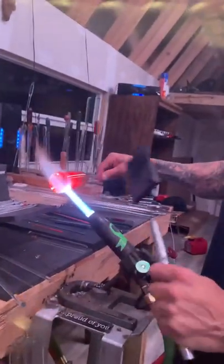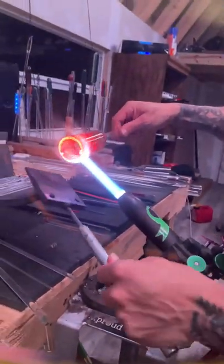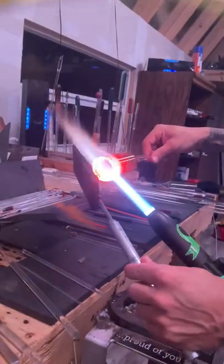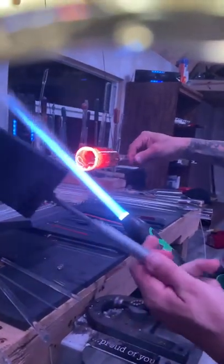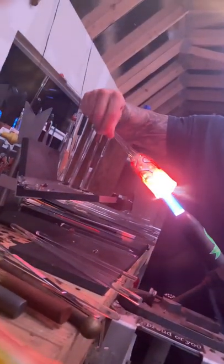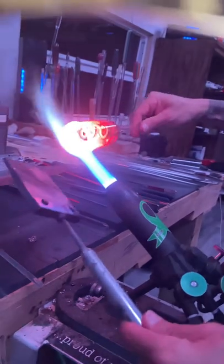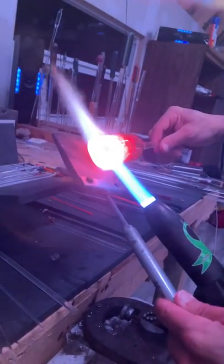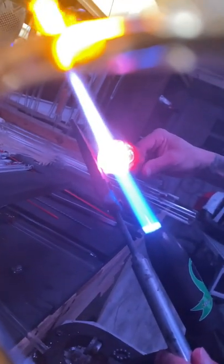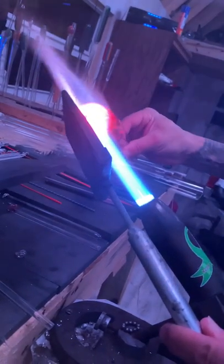I use a paddle, and the angle of your paddle is critical. You want to run it flat — if your paddle is angled, you're going to smush the glass and it won't melt down nice and even. Keep the back hot. The front's hot — roll it right on the paddle, paddle's flat. Towards the end I start to angle my paddle; you can see how it closes. I don't close it all the way with the paddle.